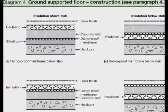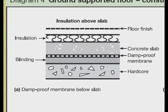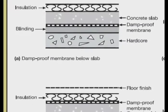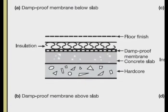Yes, it can do, and these problems typically have been spawned from an era when we didn't particularly understand sulfate attack. As you mentioned at the start, it was post-World War II where concrete was constructed in a different way to present time. We weren't using the same materials, or probably the nature of construction wasn't as good as it should have been. So the industry has evolved, and concrete designed and specified properly should actually be quite resistant. If laying floor slabs, for example, yes, a damp-proof course will be there as a matter of course, if following the building regulations, and that will provide a really good protective layer against water and sulfate in that water actually getting into the concrete.